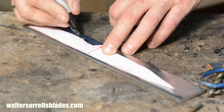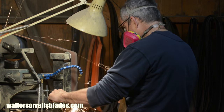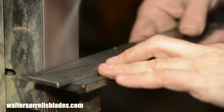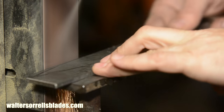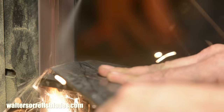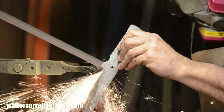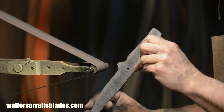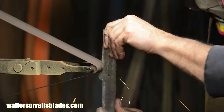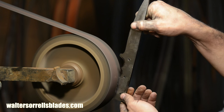Since this is a design I haven't made before, I like to keep the drawing very loose and use the grinder to work out the final shape of the blade. I'll put tape on the bottom of the blade to avoid scratching it up too much while grinding. I often see people doing really elaborate designs on paper or using CAD systems, and you end up with a knife that looks cool but has major problems in terms of construction or ergonomics. By working out the shape on the grinder and testing the feel as I go, I end up with a knife that actually fits my hand. The eye gravitates towards simple curves — arcs of circles, ovals, sinusoidal curves, parabolas — and by using the radii of various wheels on your grinder you can easily build those attractive curves into your design.